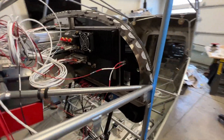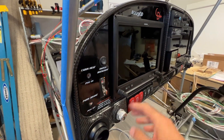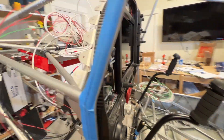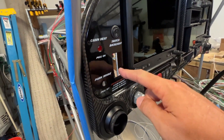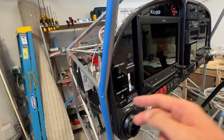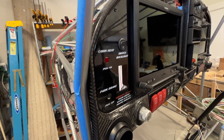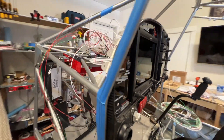Here is the switch backlight — this will just turn on and off the LEDs rather than have an LED rheostat, just a simple on/off switch in case it's too bright flying at night. Then there's the ignition backup switch. I changed the dimensions to have that fit a little bit tighter, and I changed the spacing so that I can have a black washer to support the push-pull handle for the cables for the cabin heat and parking brake. That's all pretty much stuff you've seen.